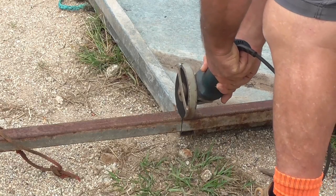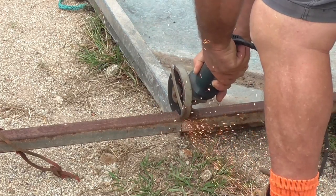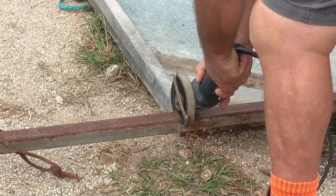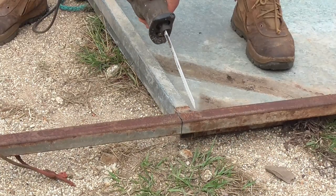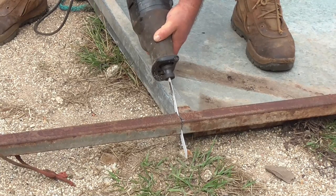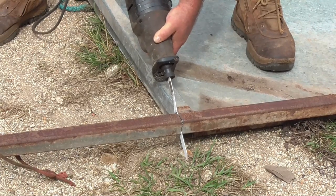I have to cut all the unneeded pieces off the divider, so I start off and cut in as deep as I can with a five-inch angle grinder, and then after that I cut off what's left with a reciprocating saw, because it has a far greater reach than the angle grinder.